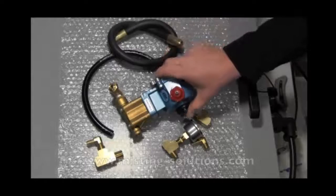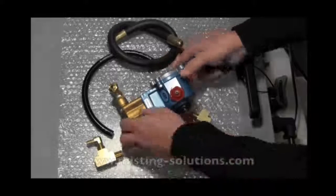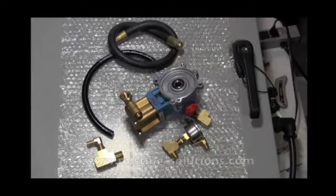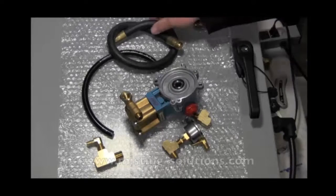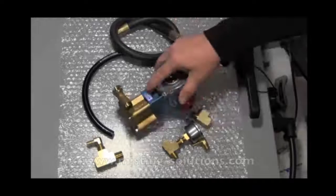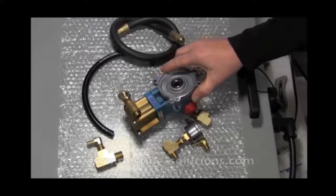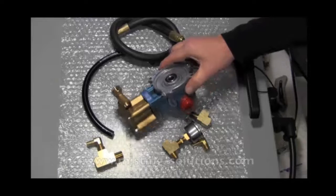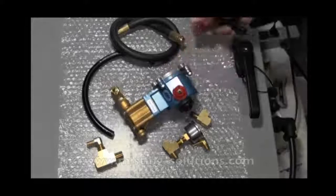However, if your discharge is all solid piping — stainless steel or copper — the pulsations create vibration, and the pulsation damper eliminates some of that. If you're running plastic tubing that can handle good pressure and is somewhat pliable, you might not need the pulsation damper. Some flexible plastic tubing with long enough runs can make the pulsations seem to disappear.